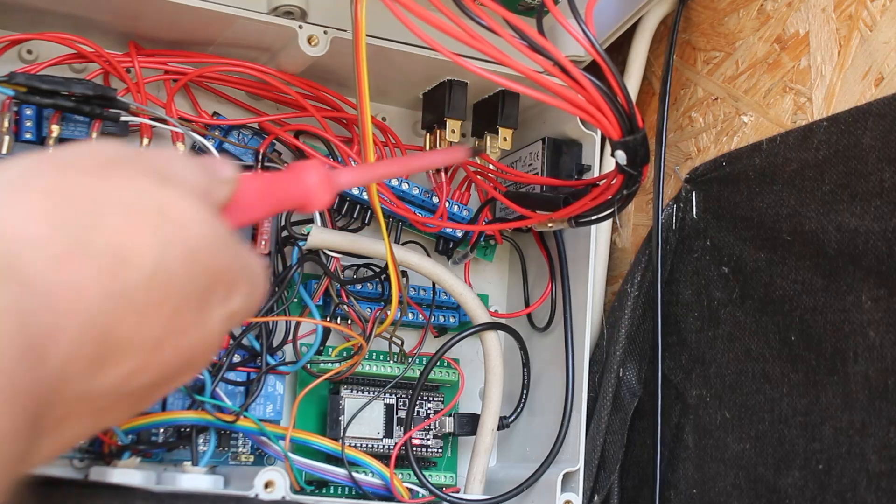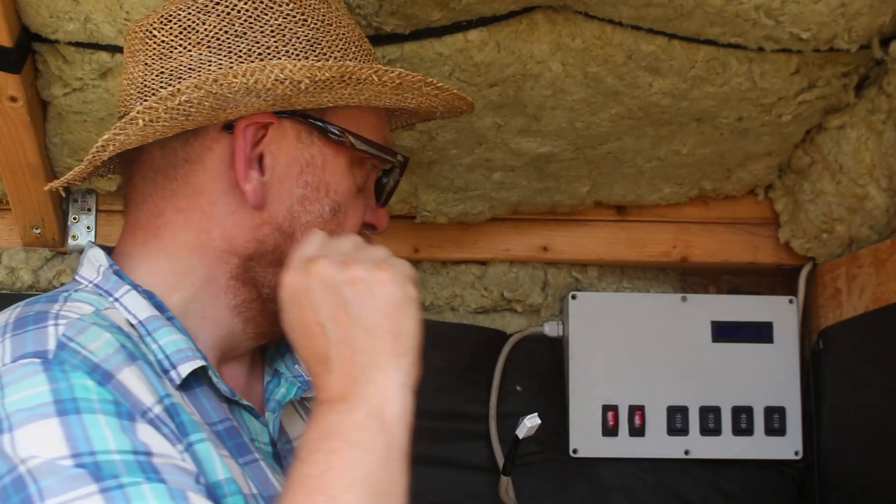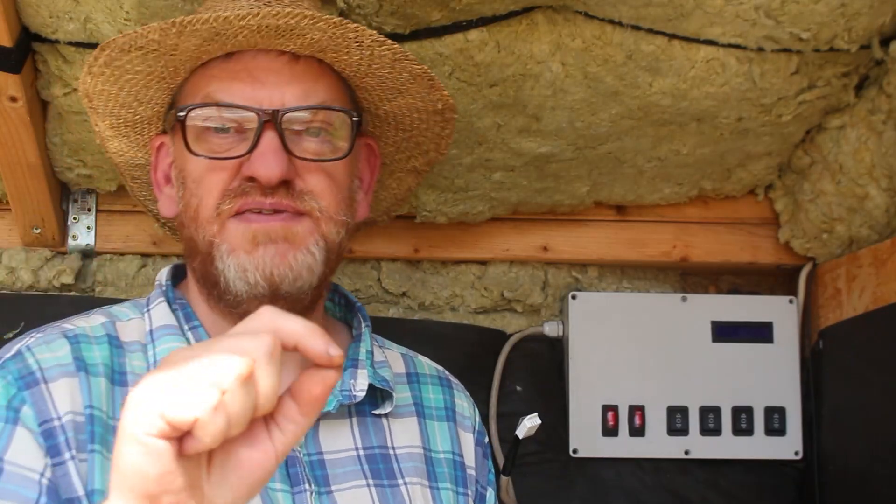Or you can put five volts directly on a pin of the controller. What I'd done, for convenience, is find a power converter for taking 12 volts down to five volts — and that plugs into USB quite neatly and arguably elegantly. But it was only feeding five volts. I've since found out through a lot of research that sometimes if you only give it five volts, it really struggles when it kicks the Wi-Fi on. So you really need to feed maybe six or seven volts in, and it will still convert that down to the 3.3 volts with the right milliamps.